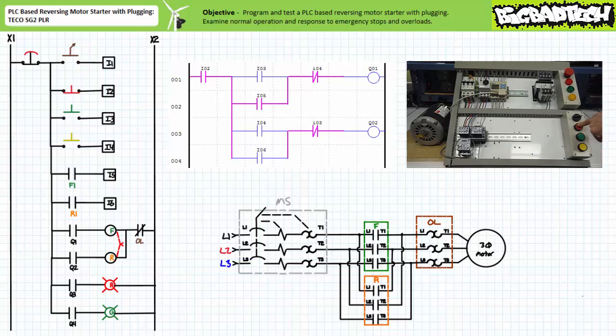When the stop button on input I2 is opened, the forward contactor coil is de-energized, the forward primary contact is open, and the motor turns off. The MAKE instruction examining input I5, the F1 auxiliary contact, confirms the forward contactor is now open and drops the holding circuit.